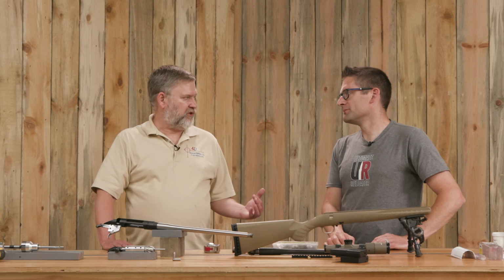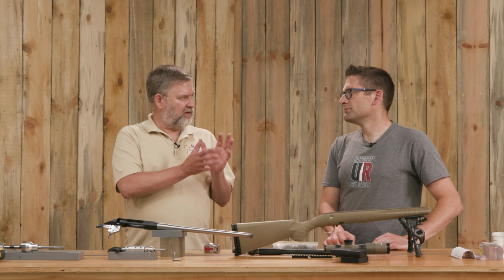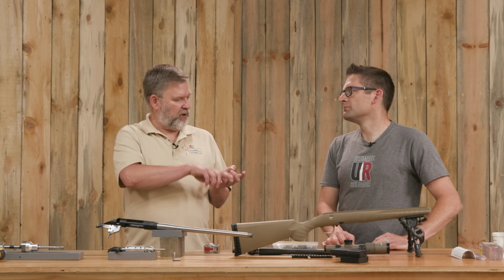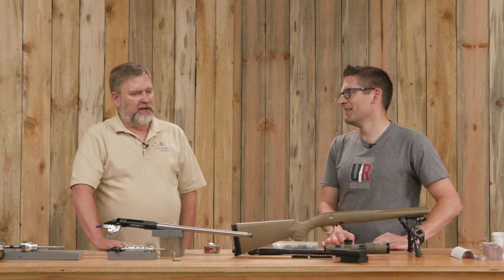That's a fact. Or chatter, right? And so that's the other thing, is looking for chatter. It's my experience that there's two things that really promote chatter. That's a pilot that's too small, so you've got the reamer allowed to float around in the bore and it's bouncing off the rifling as it's doing that. Which causes that torquing on the reamer, and of course the bouncing around will cause the opposing flute to make a cut every time it bounces to the other side. So you can end up with some pretty deep grooves if you're not careful.